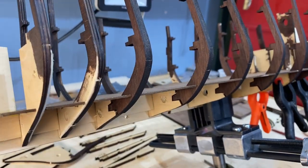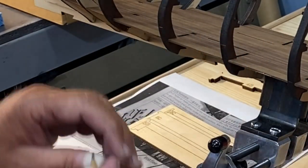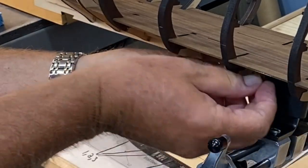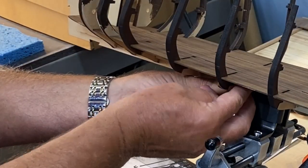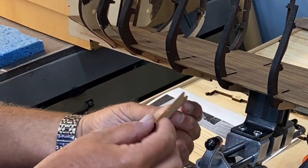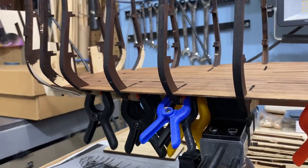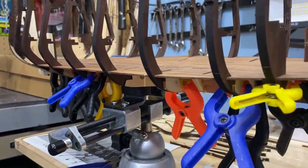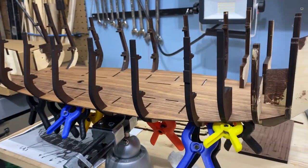Just another helpful hint for this task: I've invented the world's shortest pencil. As an example, this is rib number 10 and I can reach in there and draw a little circle or at least mark where it is, and then I can drill that out. I've got the bones — as I call them, the ribs — assembled. I've got the weak side, which would be the starboard side, with all the bracing in place and glued, and I'm going to let that sit for 24 hours.